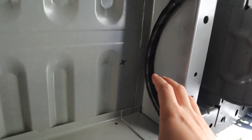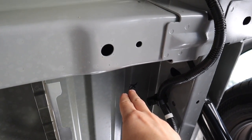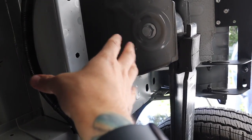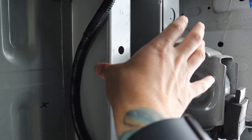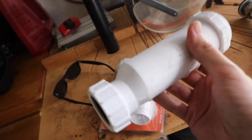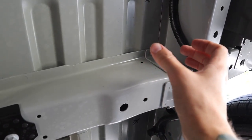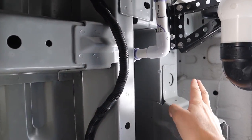Right over here in the middle — not this X but this one over here — is the front inside corner of the shower where I'm going to put my drain for the shower. The reason for that is there's just not a whole lot of room on the other side. I could mount it in the same spot I did for the sink, but that doesn't give me any room to put my P-trap. So I have an RV P-trap that's like a long straight pipe with a little valve inside that allows water to escape but doesn't allow gases to come back into the van. It'll come down, have an elbow, come back straight, go to ABS, back to where it meets the drain line with a T-valve, and continue its way down to the gray tank.